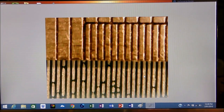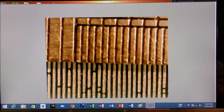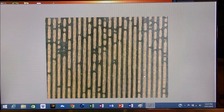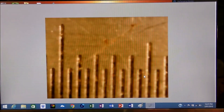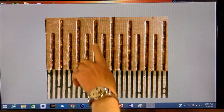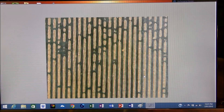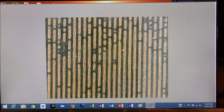First of all, I've got this little six-inch rule. It's got graduations on here: 32nds, 16ths, and 64ths of an inch, and also millimeters. Each one of those divisions is a 64th of an inch, so you're familiar with that. Each one of these divisions is a millimeter, and this is half millimeters. Each two small divisions is a half millimeter, and from here to here is one millimeter — still too big to understand how small these are.